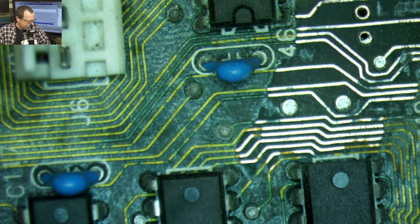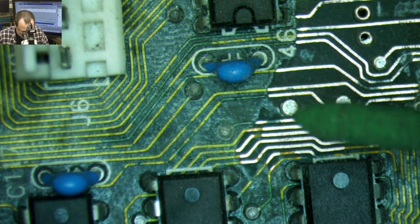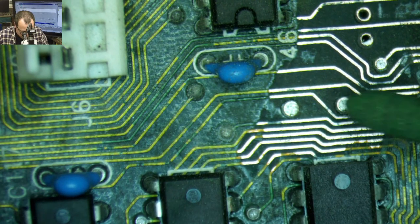Buy stock in solder mask company, says Jack68K. Yeah, that's good. So actually, when I do these, unless there's a reason that the trace looks like it's gonna get shorted out on something, I'll show you what I do in a second, but I just cover it with solder, because basically that's enough to prevent corrosion, right? That's really what we care about. If it was something that was likely to short out on something, then I would put solder mask.